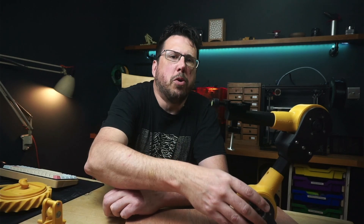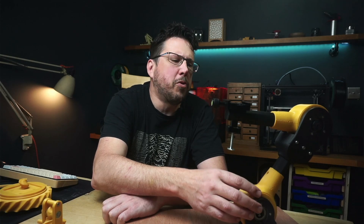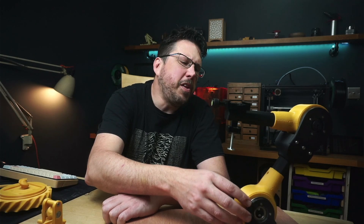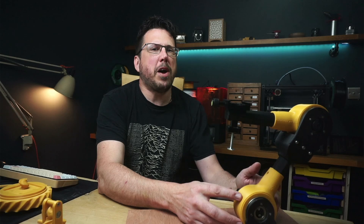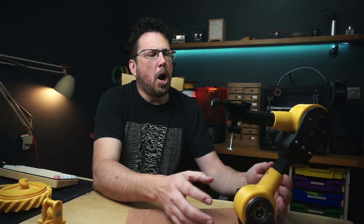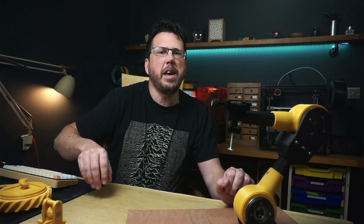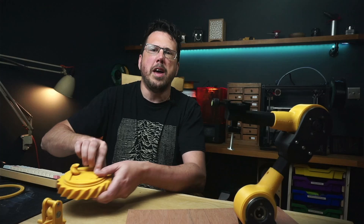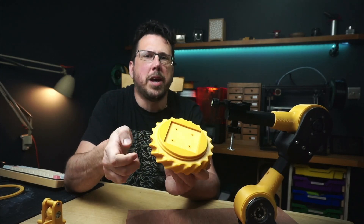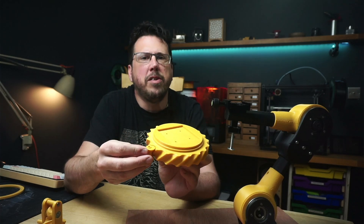I didn't use them for the elbow and the shoulder, as they're not quite as compact as the normal cycloidal drives for the same torque and reduction rates. But this doesn't matter for the base — we want the base to be quite large to give our arms some stability. I want the whole arm to fit inside the gear. So I've taken the eccentrically cycloidal gears and made this huge gear, which when paired with this little pin here will give us a 20 to one reduction.